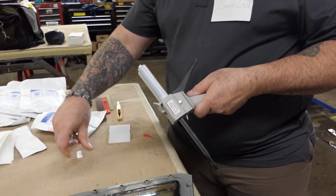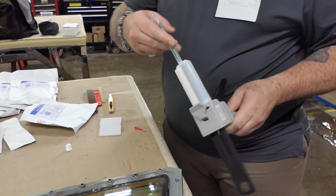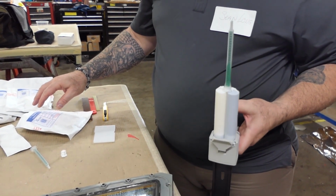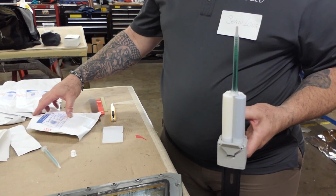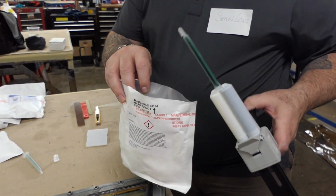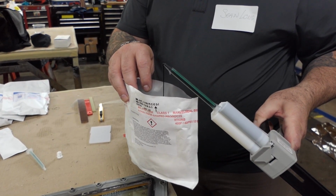Hold sealant dispenser with mixing straw upright. Completely fill mixing straw by squeezing the trigger of the dispenser. Over a suitable waste container with mixing straw pointing upward at a 45-degree angle and resin side over the hardener side, prime the mixing element by dispensing 1 full trigger pull of sealant into the waste container to remove air